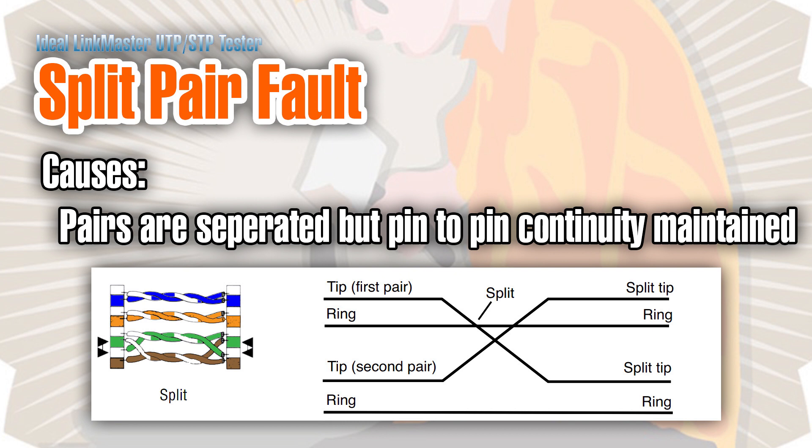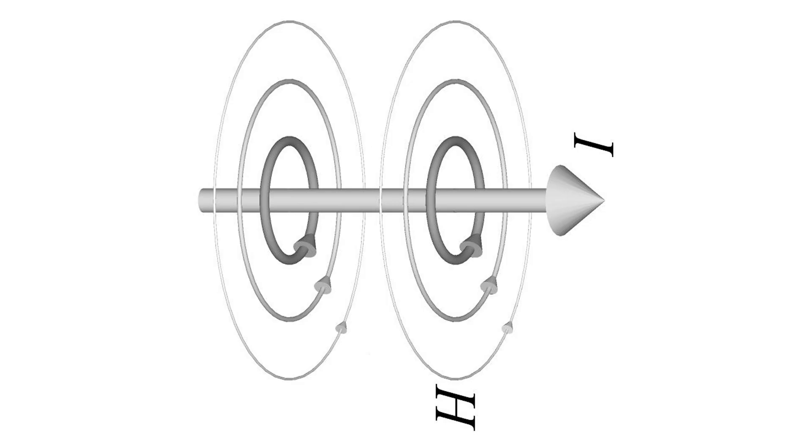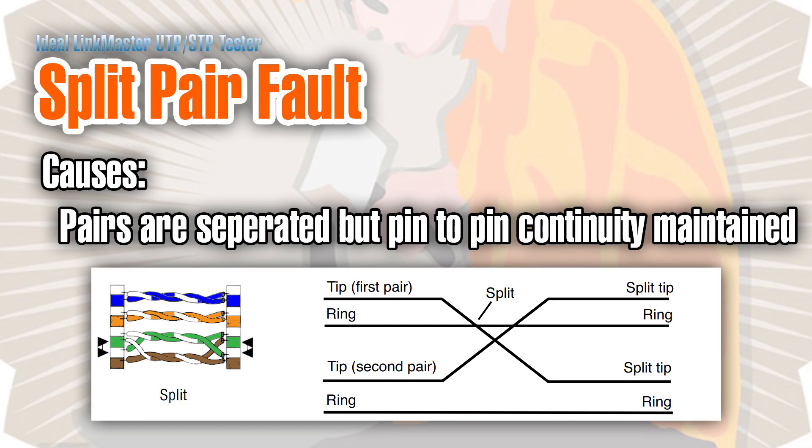The reason the pairs of wires are twisted inside the cable is to reduce interference and crosstalk. When a current runs through a wire, it induces an electromagnetic field around it, and that field can induce a current in a nearby wire. If all the wires were running in parallel, it could cause noise in other wires in the cable. When each pair is twisted, it reduces that effect — and if you pay close attention, you'll notice the rate of twist is different for each pair. When pairs are split, you can have interference problems because the current may run in a way that is not protected by the physical twisting. This could be a very tricky problem to diagnose.